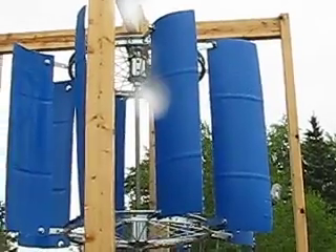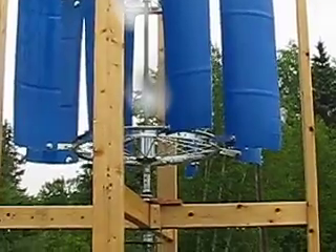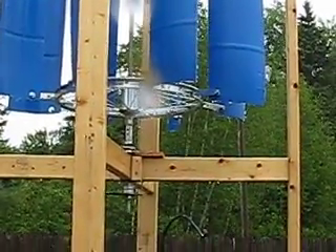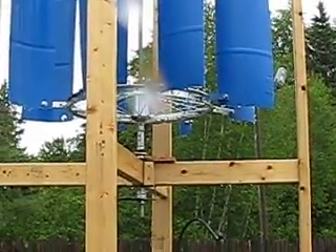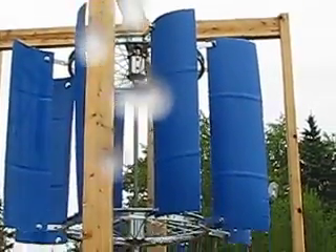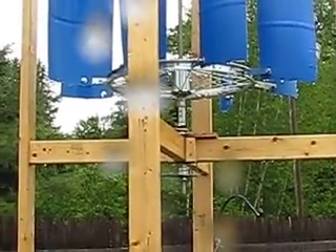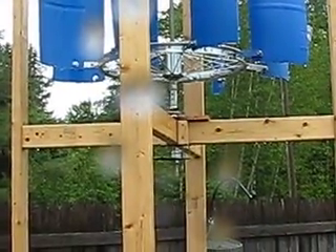The bearing I used was for a horizontal shaft — that's up there on top of this cross beam — and it doesn't allow for movement as a vertical shaft, only as a horizontal. That's why when I turned it on its side it vibrated like crazy. What I've done is put the bearing on the bottom; it really should be on top of this cross beam, but that would mean taking everything apart and reworking it.